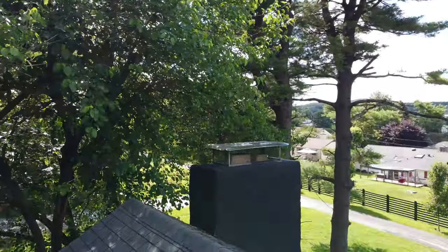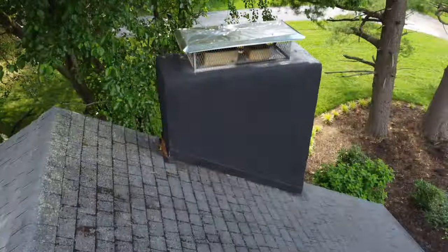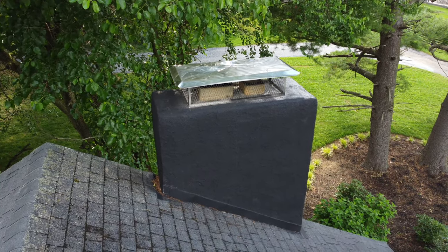But I can see that this roof is old. It's at the end of its service life expectancy and has observable defects in the roof covering material itself. There's a chimney there — it's a great way to look at the top of the chimney. We have a fireplace flue and a flue on the right side for a heating system. The asphalt shingle roof should be replaced.